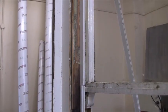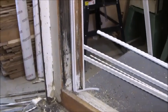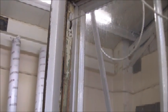So it's nice and tight at the joint. What I'm going to do is pin these in position at the top, in the middle, and towards the joint of the upper parting bead, and a couple high up and a couple low down on the lower parting bead. And what that will do is hold it in place if the wood dries out and shrinks. They're suddenly not going to fall out.